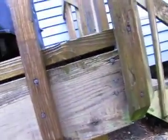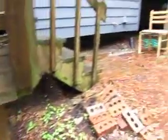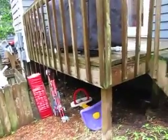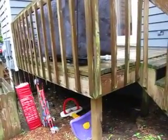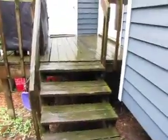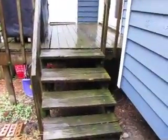Looks like they got a double band on the bottom, but that's only 2x4. That's a 2x8. And this guy, he might have a nail in him somewhere, or the whole thing might be supported by the pressure of the decking board sitting on top of the 4x4 only. So 2 carriage bolts here with the 3.5 inch 4x4 plus 3 inch 6, probably 8 inch carriage bolts, and I would get them fully threaded all the way up the bolt. Clean and seal. I taught him how to do it, but I don't know if they will.